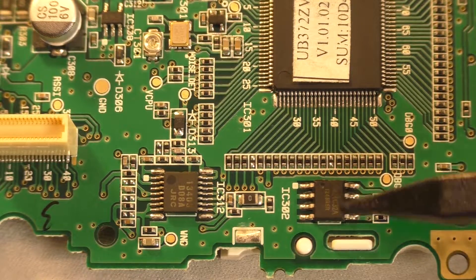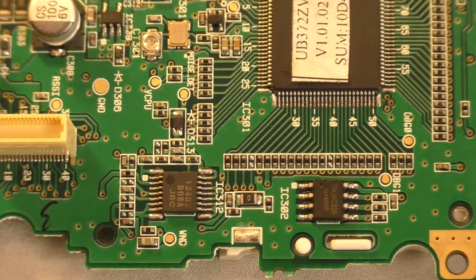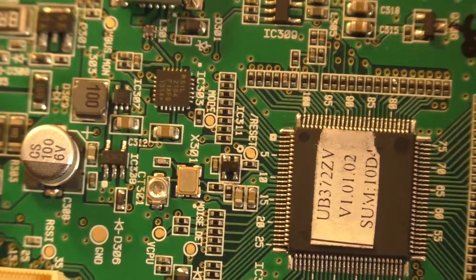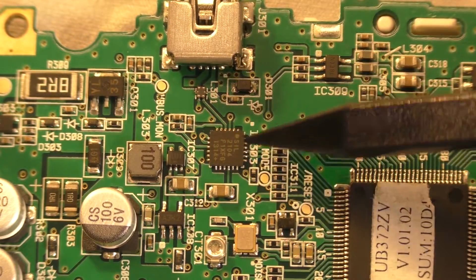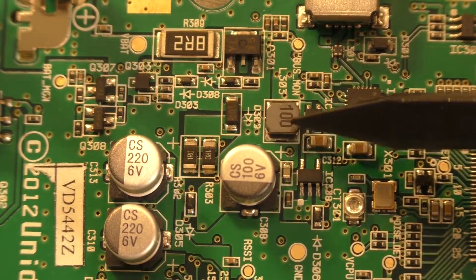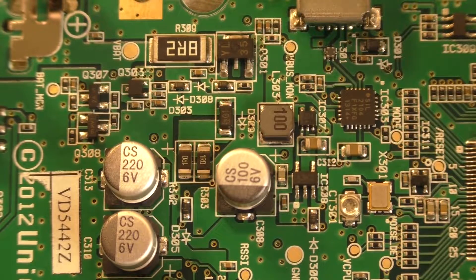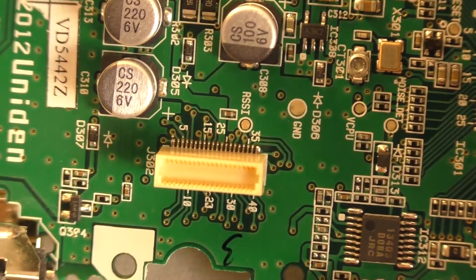This component is just a quad op-amp. This one I'm assuming is going to be memory — some form of EEPROM — because this thing can store around 300 different channels you can program in manually. And yes, this one is a two-wire serial E-squared PROM as the datasheet describes it. There are a lot of passive components, and this crystal is likely for the main chip. This chip appears to be a USB-to-serial converter, connected to the USB port. There's also some power supply circuitry with an inductor and capacitors, and this area looks like battery charging circuitry — possibly some form of LM317 — to set the current for the NiMH or alkaline batteries, with USB charging available for NiMH.